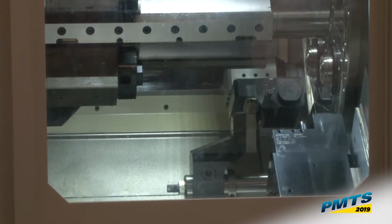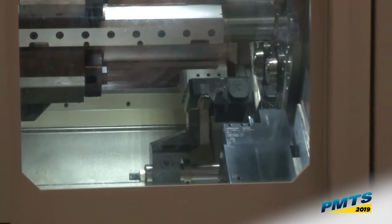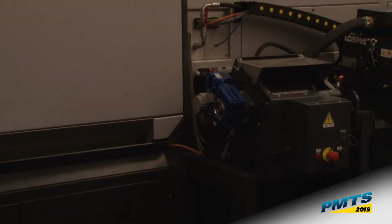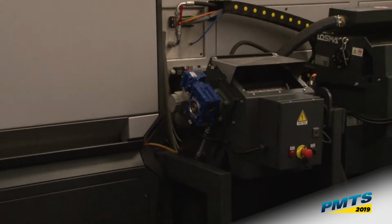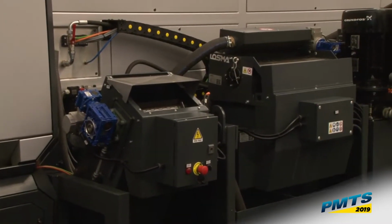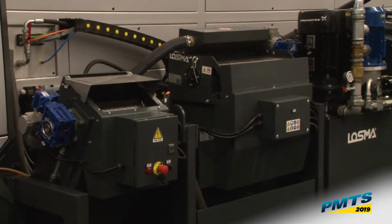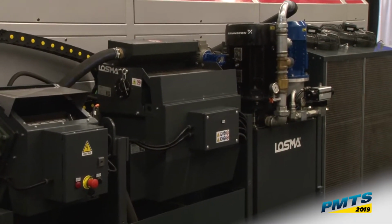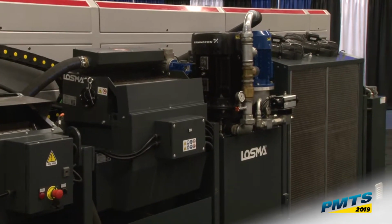Yeah, with a loader. So everything that you see here is the machine tool. High pressure coolant, 2,000 psi, 30 gallons a minute. Chip filtration down to 5 microns, either magnetic or with filter. Chiller 5 ton to cool the control cabinet and your oil. Everything on a quick change rack with a bar loader. The bar loader is on guide rails.